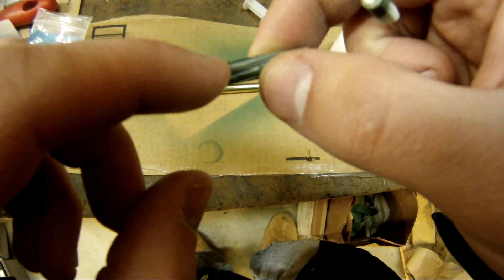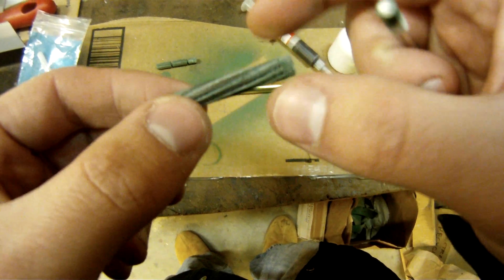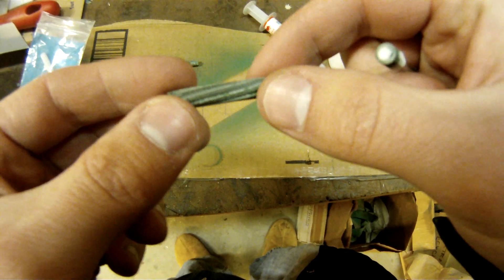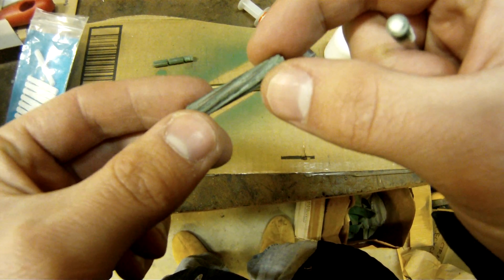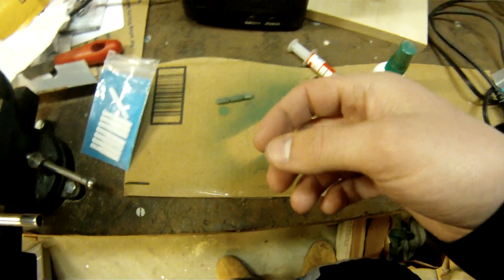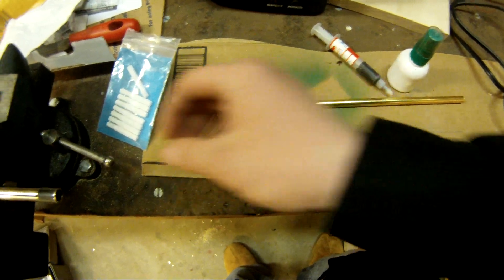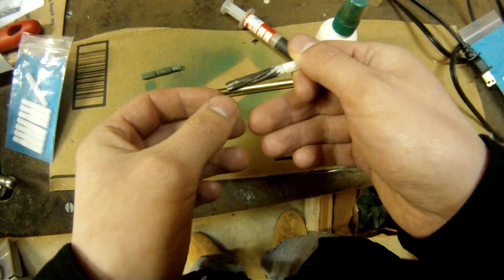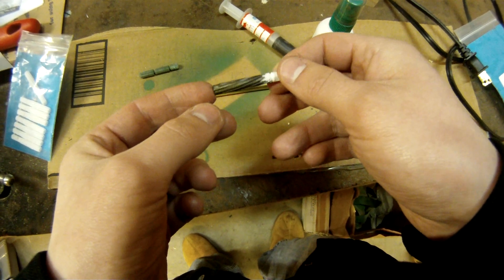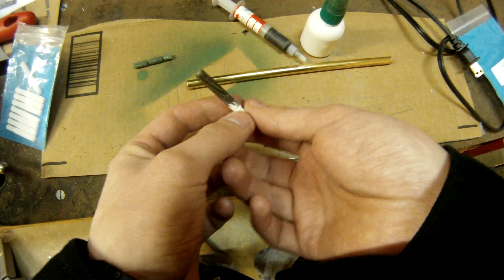If you can see coming up here, these are the actual cutting surfaces. They're slightly angled to bring compound up onto them, and they cut the barrel — again, tapered, thinnest here, thickest over here. You can see each one has quite a bit of brass on it. Here is the one I originally used with 40 micron to cut the barrel, and you can see it's loaded with brass — it's cut out from inside. It's pretty simple to use.